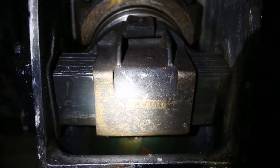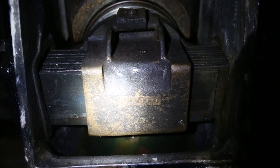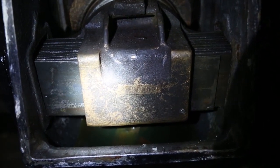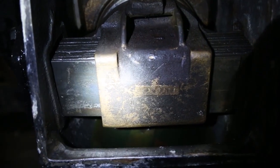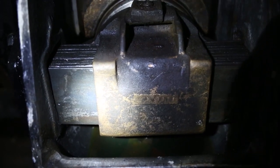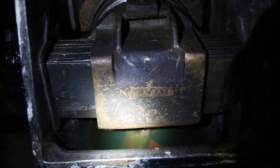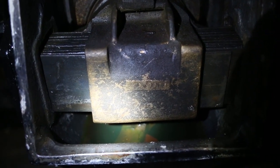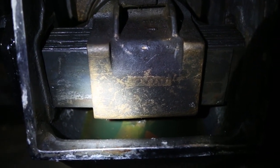Railroads don't use it anymore. The biggest problem with it is that you've got to maintain it. You've got to oil it every so often, and when you have a 100-car freight train and somebody forgets to put oil in one of the journal boxes at a terminal, it has problems. So the biggest advantage to roller bearings, which all modern rolling stock, locomotives, passenger cars, and freight cars have, is that you don't have to do any kind of maintenance to them.